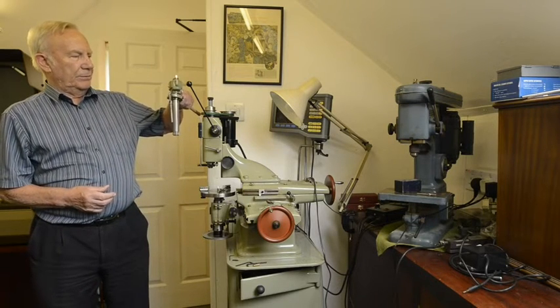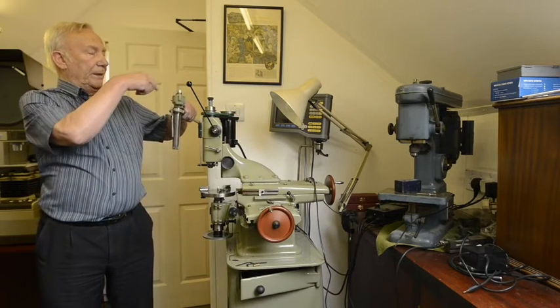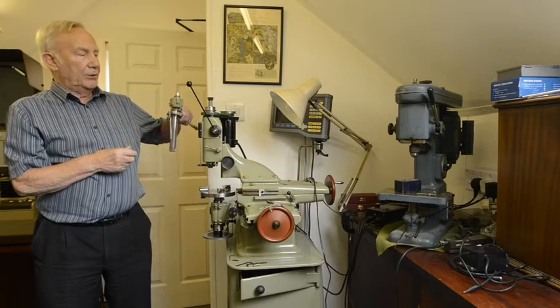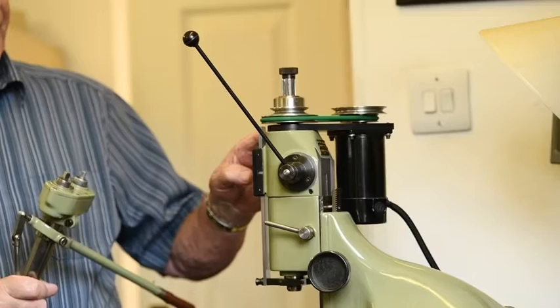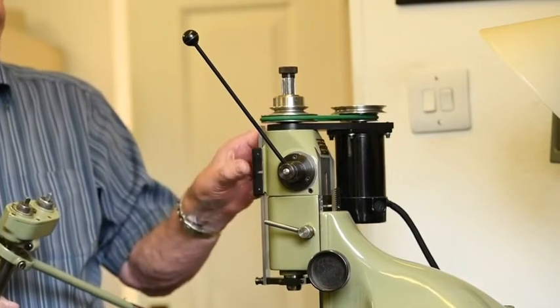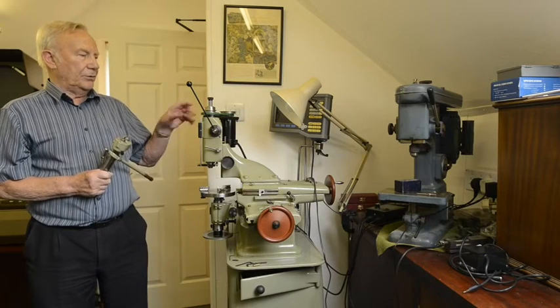This is the original quill, which is driven from a pendant motor and a flexible drive, which is quite crude in a way. So I designed this head, which you can take out — slice it out — and you can put the microscope in here. This is on a magnet; you can slide it off and it takes just seconds to change the head.